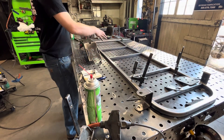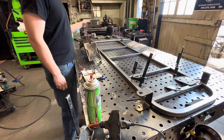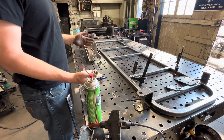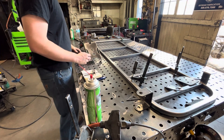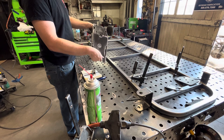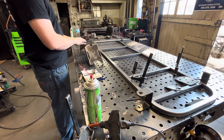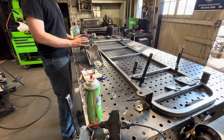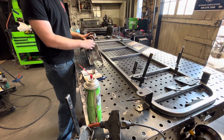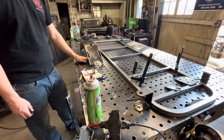You can see our frame — a fairly unique, simple design for the main frame layout. Each component is spaced directly for a certain object so that placement is best for each individual. Go-karts can only be so good; it's obviously not a vehicle with luxury comforts. This is our three-piece frame made out of 3/16s. The front and back holes are perfectly in line with the drain ports, so people can thread in a hose and run it through — it'll drain right out and keep the project nice and clean.